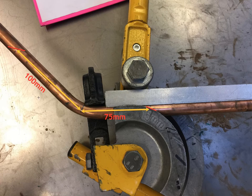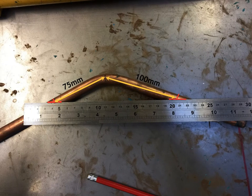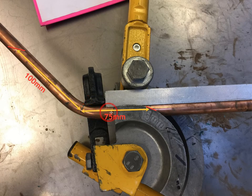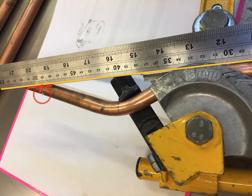You're going to turn it back over now because you've obviously bent it down — now you need to bend the arms. So flip it back over. You can see that the 75mm mark is placed in the benders. Before you bend, there are a couple more things to do. Get your long ruler and place it in the gap between the roller nut — you can see it there — running horizontal along the pipe. Keep the gap so the bottom edge of the ruler is touching the bottom edge of the pipe. Set the pipe, check for square, then bend the arm with the ruler in position. That ruler is going to come up slowly until it touches the second line — the 100mm gap line. Not further, not less — in line.